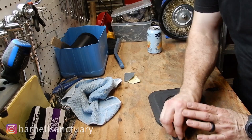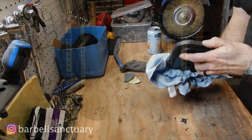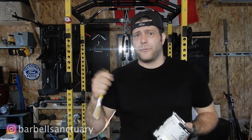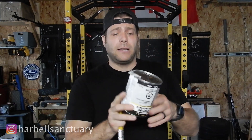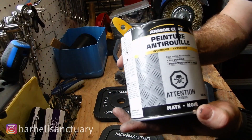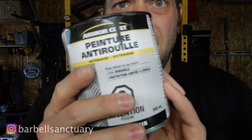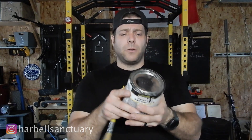So you just sand it up, and then when you're done sanding, use a microfiber cloth — you could clean with alcohol or whatever, I don't bother — just wipe it off with the microfiber and that'll absorb any of the dust. Then I grab my favorite Dollarama brush from the dollar store, or even a foam tip brush could work very well, and I paint with a rust paint. It could be Rust-Oleum; I got this Armor Coat one from Canadian Tire. It was cheaper — flat black matte paint with rust prevention.